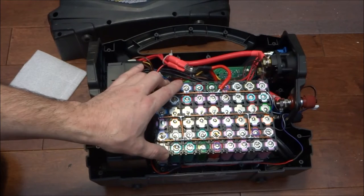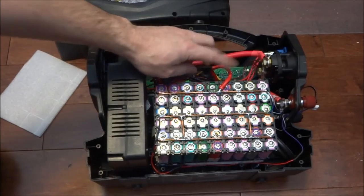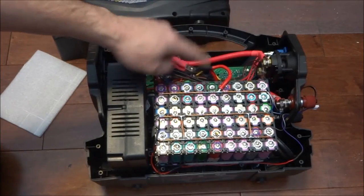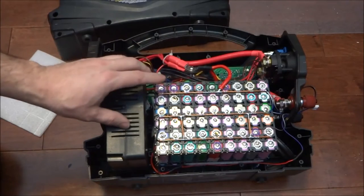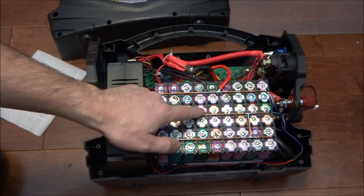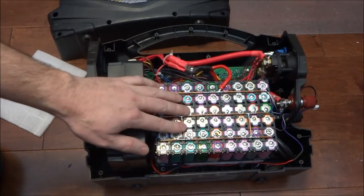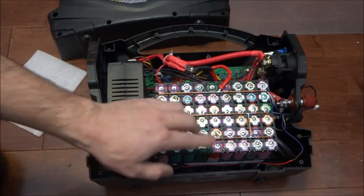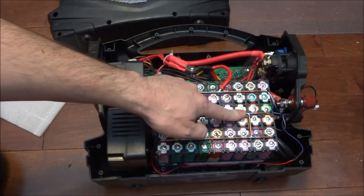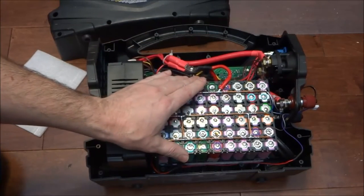As you can see, the wires I'm using are 8-gauge — one for this group and one for the group underneath. For the positive and negative connections, these are all soldered using a very thin wire. I use resistors that I cut, which act as a fuse if one of the cells goes bad, and they're also very easy to solder. This group of cells positive connects to the next group's negative, and this ends up being the positive for this group.